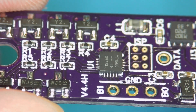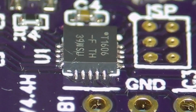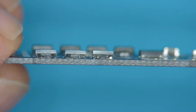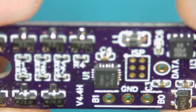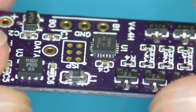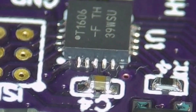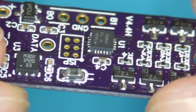There is our cleaned board — I just want to make sure the joints look good. Looking at that microcontroller there you can see five distinct pins with no bridges between them — that's the sort of thing I'm looking at. I'm making sure nothing is standing up off the board; I want a good solder joint everywhere. The most common place you're going to run into an issue is going to be on the microcontroller on the side with the capacitor next to it. That middle pin is connected to ground, and because it's connected to ground it sometimes doesn't come up to temperature as quickly as the other components in the area, and the solder might not flow correctly on it.